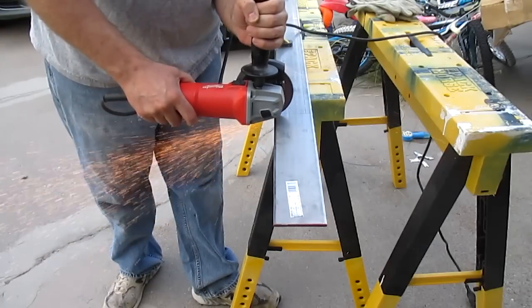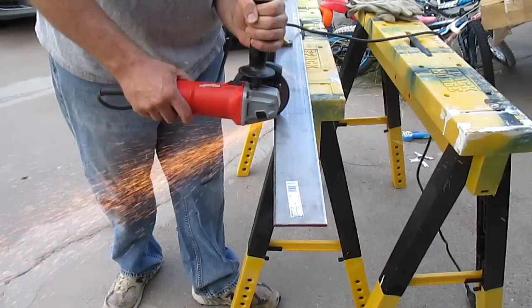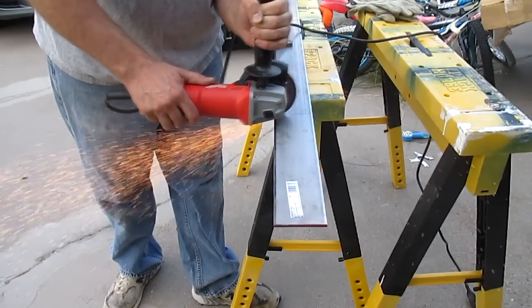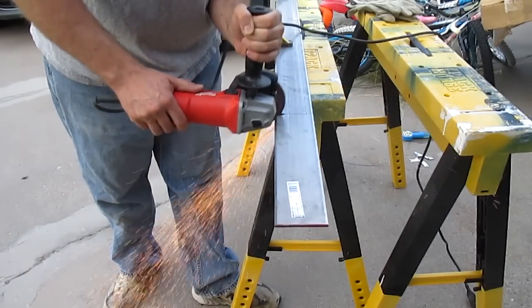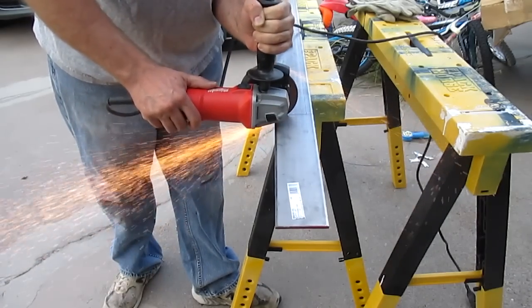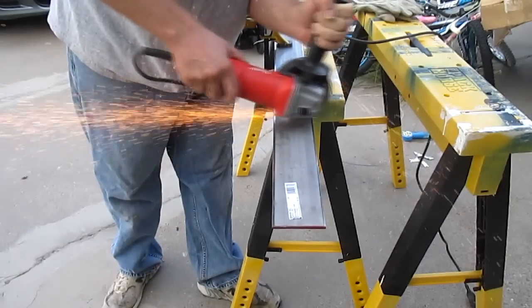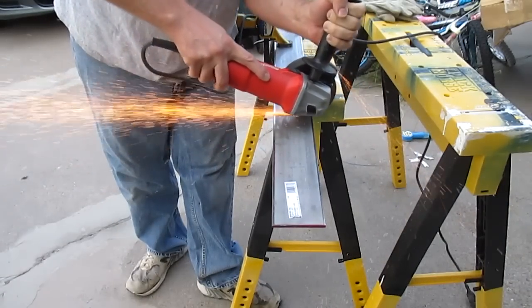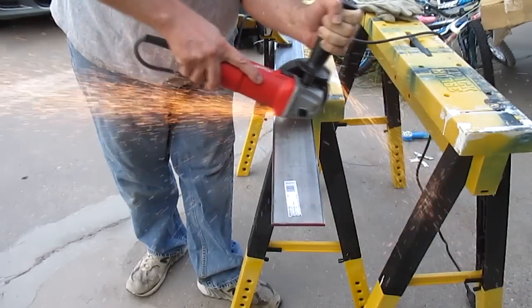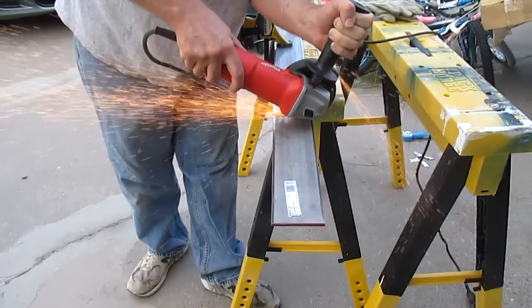Using a piece of 3/16ths inch steel, I cut it to 36 inches long and 2 and a half inches tall. That leaves it flush with the top of my maker slides and leaves about 7/8ths of an inch sticking out underneath that won't interfere with the X carriage, the spindle, or project material. After cutting the steel, I applied a thin coat of Rust-Oleum gloss black paint to prevent corrosion and to make it look nice. It's also a good idea to mark which maker slide is the front, which one's the back, and which side of the steel is going to face the front.